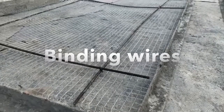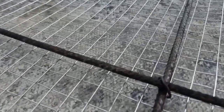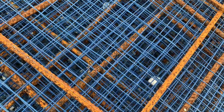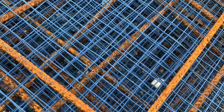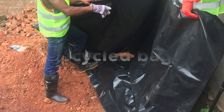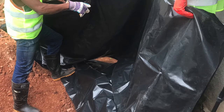You also need binding wire for this job, because your wire mesh and cutter rods are what will be used — you use the binding wire to hold them firmly in place. For the wire mesh I prefer the coated ones; you can see them in shops in blue or green. There's not much difference but I feel they last longer than uncoated ones. You also get a recycled polythene bag or rubber carpet for the floor so the slabs don't stick to the ground when you cast.